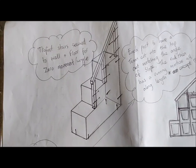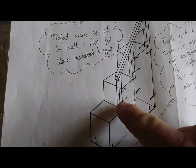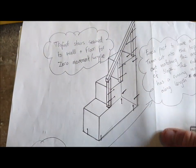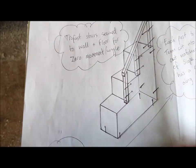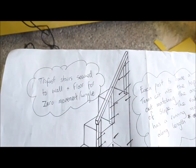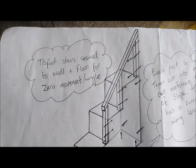Here are some quick sketches for the handrail, just to get things straight in my head and try to overcome any potential problems before the build process. These two rail posts at the bottom are going to be secured through the IKEA unit. The top one is going to be near the wall but not right up against it. If I want an even gap between the posts I'm going to have to cut down another post to the right width and use it as a wall plate — secure it to the wall — and then the top post will be glued up against that, securing it to the wall seamlessly without any fixings on show. It should still be removable in the future.